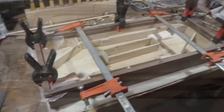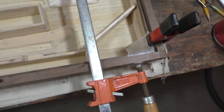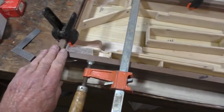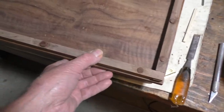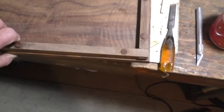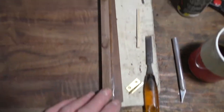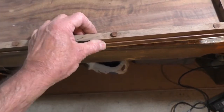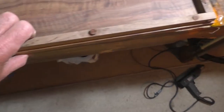I'm going to be ready to glue up. I've got the framework for the top glued up now. I've got wax paper in the corners so it doesn't glue down onto there. Now I can level it all out after the glue dries and then glue the top down. I laid it on the bottom and clamped the top to it, and after the glue dried I drove number eight by three-quarter inch screws from the framework into the top and plugged them, so there won't be any plugged holes on the top, just on the frame.